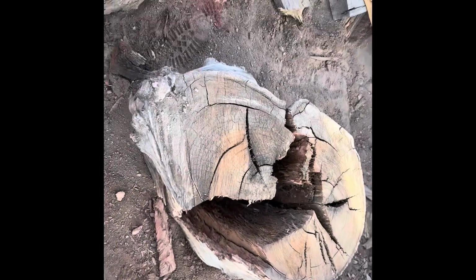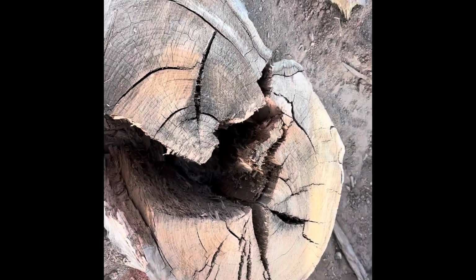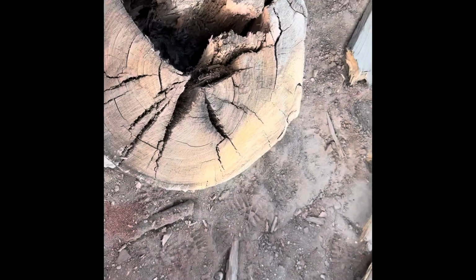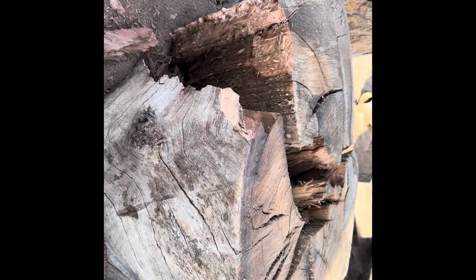This here is another species. It's kind of yellow gray in the middle, but the thing about it is, I've probably mentioned it before, almost all this eucalyptus seems to have about a 2-inch thick rind, or maybe it's the sapwood when the tree's still growing, but on this, the sapwood is growing sideways, and so it's almost impossible to get a good straight split on the outer wood.